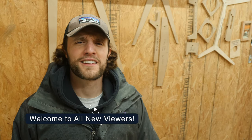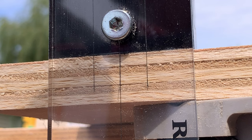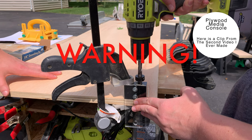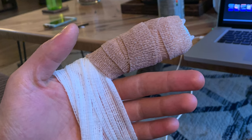Yes. Most of you probably haven't seen this — it's a pretty terrible video, I think it's my second video ever. I was building a TV stand and I was using a doweling jig, which has a drill bit with a collar on it that stops so it doesn't go all the way through the wood. I didn't have the collar locked down all the way, so I drilled through the wood and it went through the wood and into my fingers. Make sure the collar on the drill bit is actually tightened down and you don't have your finger below where the drill bit would be — just in case it slips through and you have to go to the emergency room.